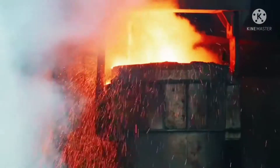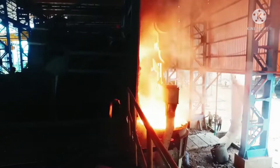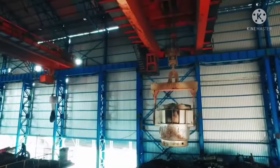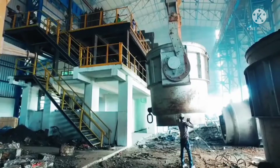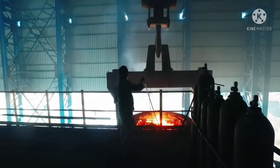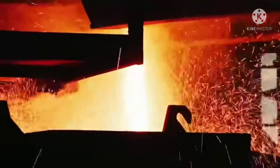After the molten metal has been extracted from the crucible onto the casting ladle, it is first stirred with nitrogen to gain homogeneous chemistry and uniform temperature throughout the ladle. The ladle is then taken to a continuous casting machine where it is placed onto the ladle car.